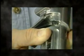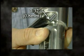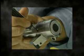The final adjustment is to check the blade for proper stripping position. To do this, place the tool with the bushing installed over the cable end. The blade should be approximately 1/32nd of an inch (.8 millimeters) above the conductor surface. If the blade is too deep or too shallow, simply make the necessary adjustments using the blade adjustment screw.